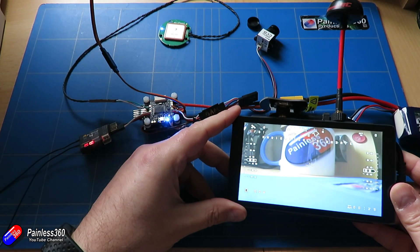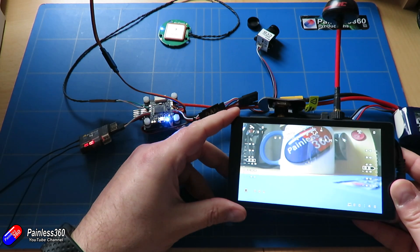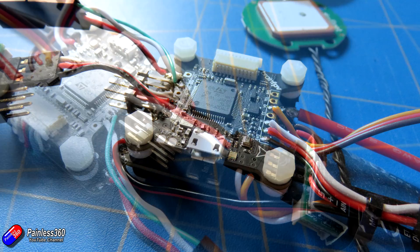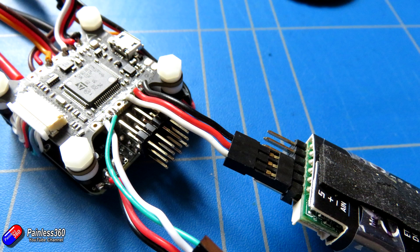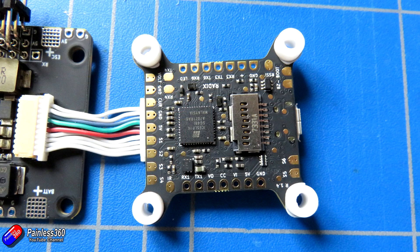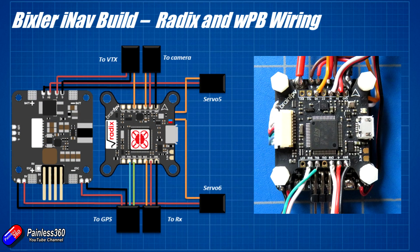Now you know what the ports need to be, how I've got the GPS working, and how it's all wired in — we're ready for the next video. You may have spotted a couple of extra cables I haven't talked about: those are the servo outputs connected to the S5 and S6 pads, which are the additional two servos. Those pads are underneath the Radix next to the USB cable. I've connected the signal pins of those cables to those pads, picking up 5V and ground from elsewhere, hoping they can run the pan and tilt servos on the FPV gimbal.